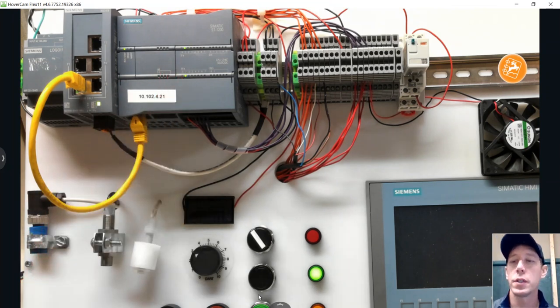The best thing we can do is match our input devices with what the PLC is set up for. If your PLC is set up for sourcing devices, make sure you buy PNP transistors for any three-wire input devices so that they are set up for sourcing already — that's the best way to do it.